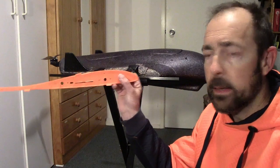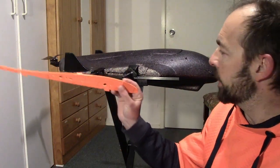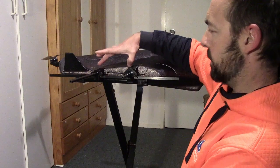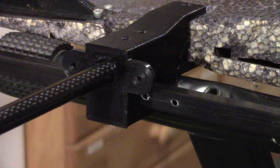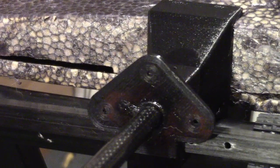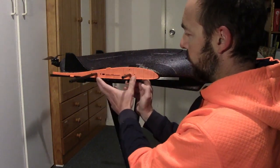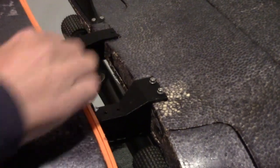Given that I will now need to work to tune the PID parameters, I certainly won't do any further flights without having the wings attached. So I've come up with a plan for how I'm going to connect the wings, using the original connection points that come with the X8. I've redesigned the 3D printed mounts so that they've got a little adapter flange, and then I can slide the wing attachment onto the carbon fibre tube, connect that to the 3D printed pieces with bolts, and then connect the wing.